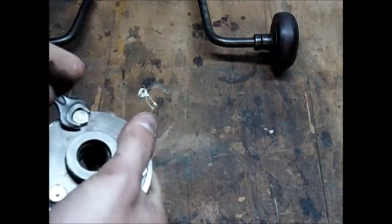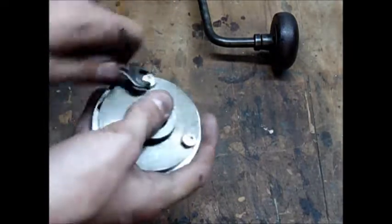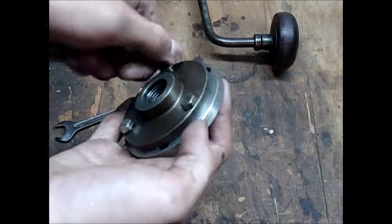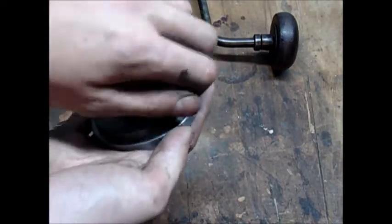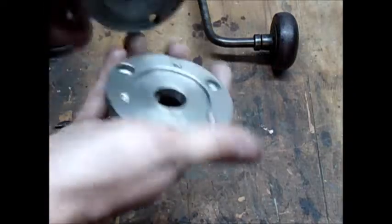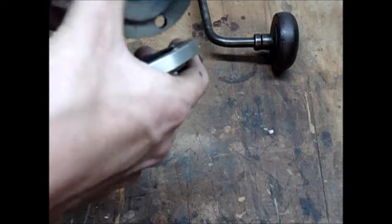So that is why that would have caused us severe problems to machine this thread, and we decided to take the old flange and copy the registration principle that the chuck relies on, and just make a new flange which has a registration surface as well. So this flange here sits on the surface of this flange.